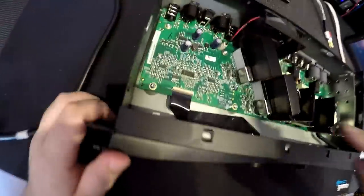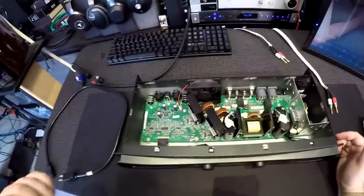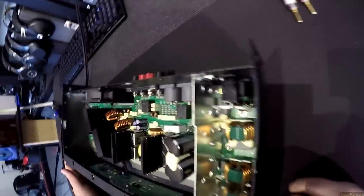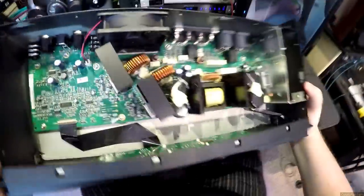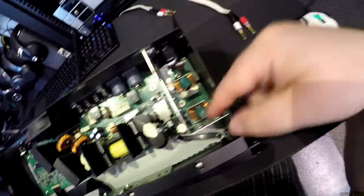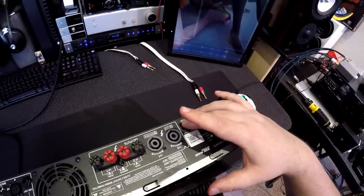So what's in here? We've got these heat sinks on big vertical planes — four of them. Got an active fan which only comes on when it's hot enough. I have not pushed this to the point where that fan has come on or made any noise at all. Got some caps here — two big ones. I see 200 volt, 1800 microfarads. And these are 300 volts — I can't tell how many microfarads because it's behind the heat sink. You've got this little baby transformer, here's where the power comes in with a standard power connector. And you've got auxiliary ground with sleep, ground and status — so that's for controlling this remotely.